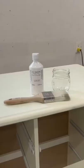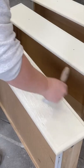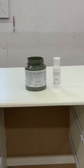Once that was dry, I sanded the filler smooth with some 220 grit sandpaper and also used that to scuff up the rest of the shiny factory finish. For a little extra adhesion insurance, I primed the dresser with this ultra grip primer from Fusion Mineral Paint, brushing a coat over the entire piece.